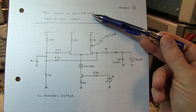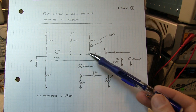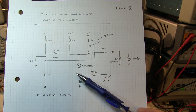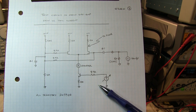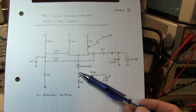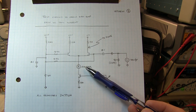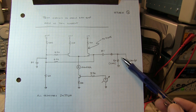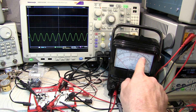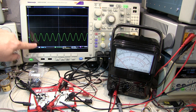This is the test circuit used to show differential amplifier gain versus tail current. I've got a simple diff amp set up here, a resistor divider giving about 4 volts to bias both sides of the diff pair through a couple of 3.9K resistors. I've got a variable current source — a simple single transistor current source driven by a variable power supply. As we ramp this power supply voltage up, that will increase the tail current measured with an ammeter. We'll also be monitoring the output voltage on one side of the diff pair, and driving the input with a function generator, AC coupled into one side. The Simpson 260 meter is monitoring the tail current. Input voltage is about 100 millivolts peak to peak; output voltage is measured on channel two with a 200 millivolts per division scale.